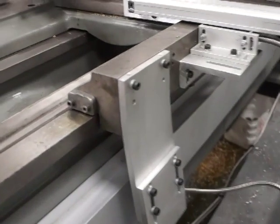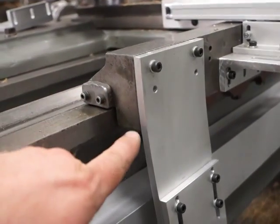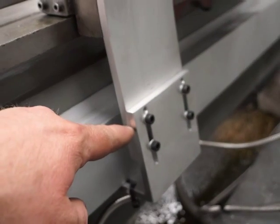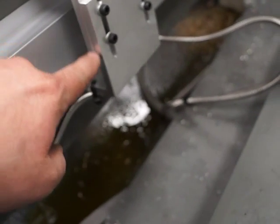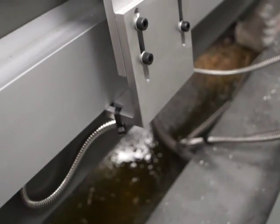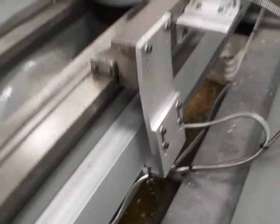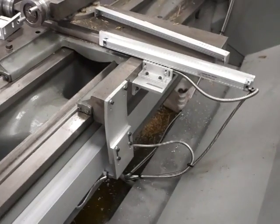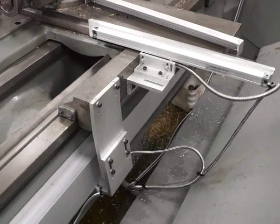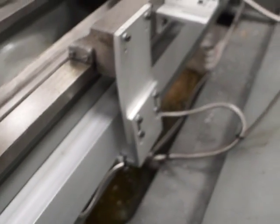Moving down to the bracketry for the Z-axis: we drilled and tapped into the carriage at two points. On the Triumph, this is a bent bracket, especially bent to seven and a half degrees. It fastens at the large angle and then screws into the bottom of the reader head on the Z-axis with two M4 socket cap screws. This principle applies for the Triumph, Master, and Student — on the Master and Student, this bracket won't have a bend in it; it'll just be straight.